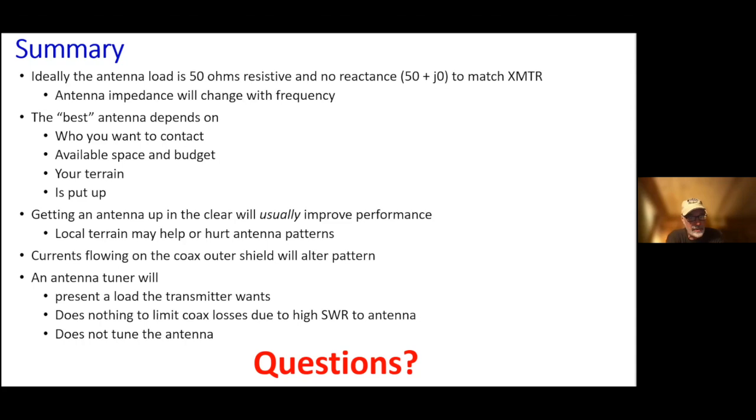So, a kind of related question boils down to, can antenna efficiency be measured? Knowing that the SWR talks about how much reflection is going on, and you want to have the whole system minimize the reflections. You can't measure antenna efficiency with an SWR meter. Is there some way to measure it? You need a power meter. Yeah, there is, but it's not with an SWR bridge. That just tells you the match. You need to be able to actually measure currents and or power.